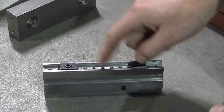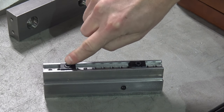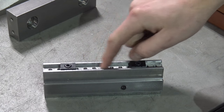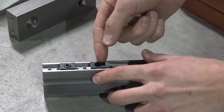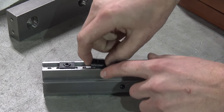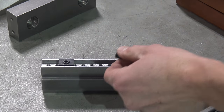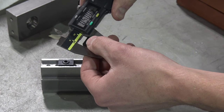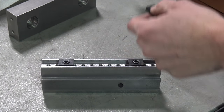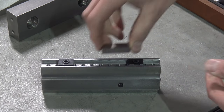It's a really pretty simple job. The one thing I suspect about the way these work, this is a 10-32 cap screw, is there's a really good fit in this slot. That way when you're pushing against it, it's not being held by the screw so much as it's being supported by this backside right here. So these measure, if you trust calipers, just at half an inch. Let's though take a set of gauge blocks and see what it really measures. So if I take a half incher, 0.5 gauge block,